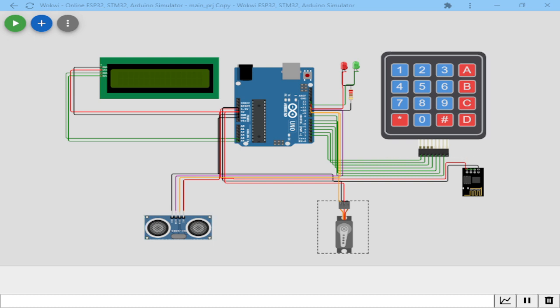Next to it, we have a servo motor. As I've highlighted, a servo motor is just a typical motor, but with an additional improvement: you can control it using any of the pins through pulse width modulation, PWM. You change the width of your modulation. It's like you're interfering with the frequency of the voltage that you're serving into your motor, and it makes the motor behave as you wish. You can change the position of the motor, the angle of its arm, as you wish. We are going to see it working when I play the simulation.